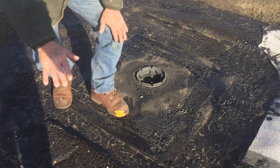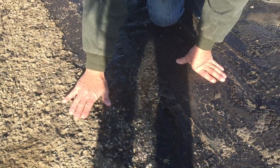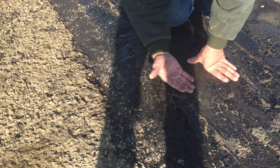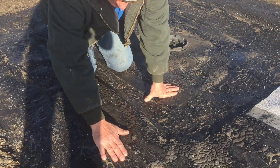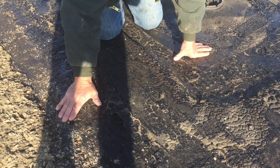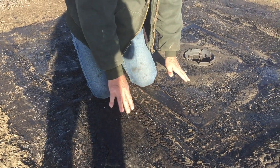On this commercial roof, this drain was leaking so bad in this warehouse. The problem was — I have a photo of it — where the previous people came to repair the drain. Here's what they did: they went over with a membrane over the stone, and tar over the stone, and the water was coming underneath that layer and just leaking in. So what I have to do is clean this surface where the original roof is and put a membrane transition from the roof to this drain again.